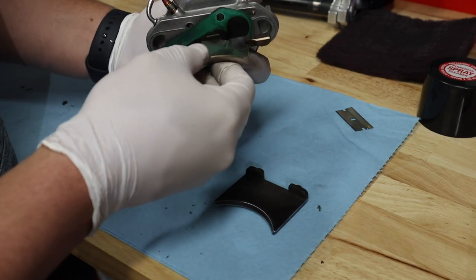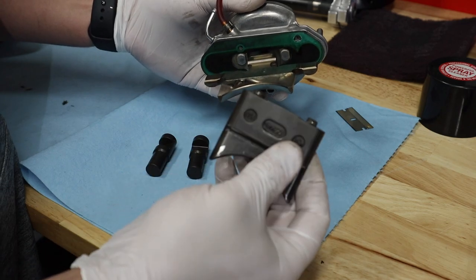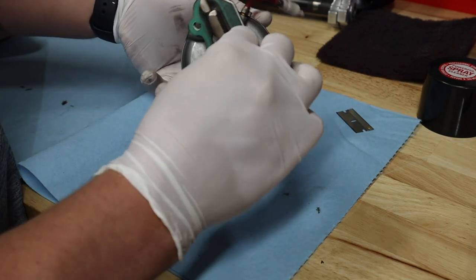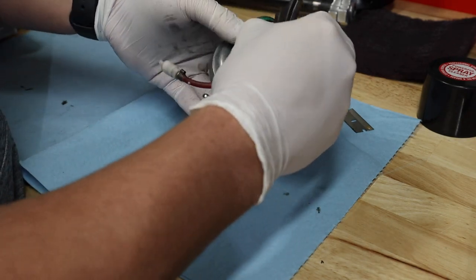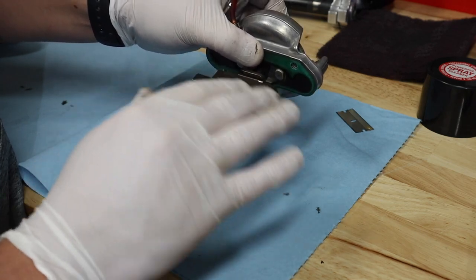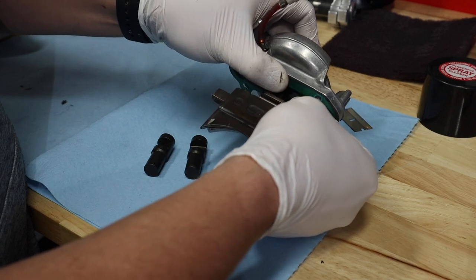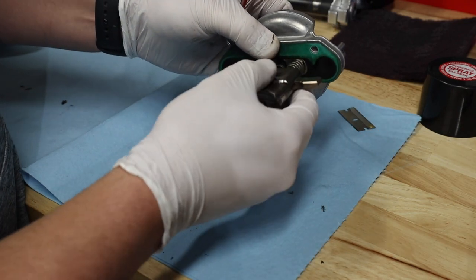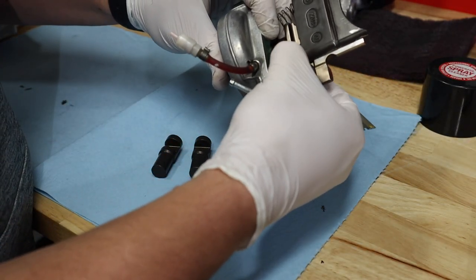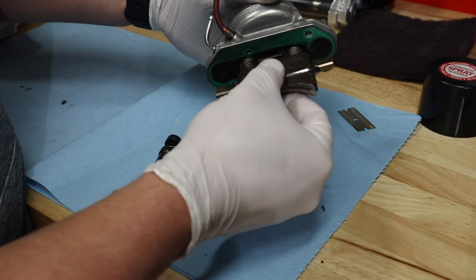At that point, push on your diaphragm again, then take your slide from the opposite end, slide it up in there, let it retract, and now the slide is connected. At this point we can go ahead and put our springs on — push this out and attach our springs. The springs are what holds this slide together so that it doesn't move and cause us any issues. Attach it from this side first, then come over to the slide. One spring is not going to hold it out for us, so we've got to continue to hold this out. Attach the spring there, and then again on the slide. Now between the two springs it is holding it out and you can see how this is going to move.